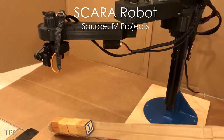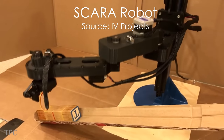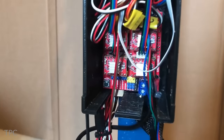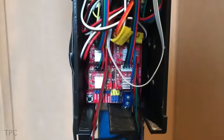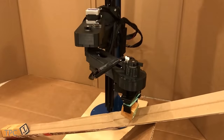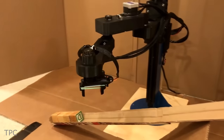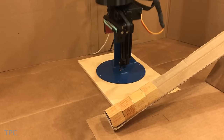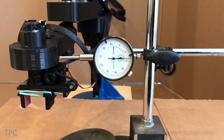Number 3. Next, we have a SCARA robot, which is designed to handle 200 grams of load. The electronics include an Arduino with a CNC shield, four stepper motor drivers, and a 5-volt regulator for the servo. This robot uses open-loop control. Just like a 3D printer, the robot can keep track of how far each motor is moved, but it doesn't know where it starts from.